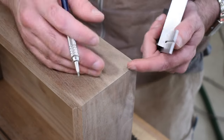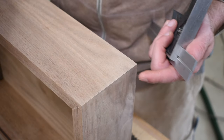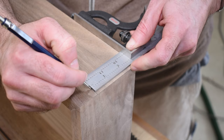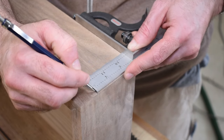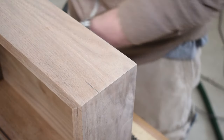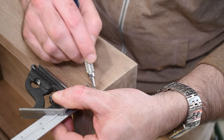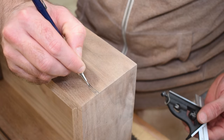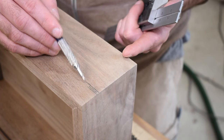With the box glued up, now I can make my layout marks for where I want to cut the lid off, but also where I want the splines at. So I will make a mark for where the blade is going to be whenever I cut the lid off. So that will be one side of the blade, and then this will be the other side of the blade. So we'll cut this section out right there. The blade's gonna cut right in the middle of this.